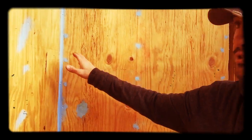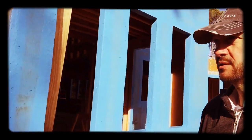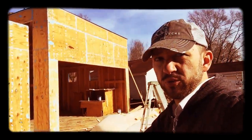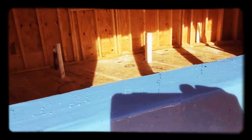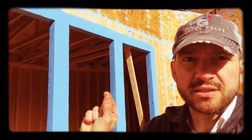Once the detailing is done — covering nail holes, seams, all around the windows where the seams are, other nail holes — and these corners are extremely important. Once we have all the detailing done, we wrap all the windows. We're still at that stage. You can see back here behind us — this is their 2400 product. You can see it goes on at about a 40 mil thickness. That's bubbling up because of the temperatures, the sun beating down on it right now. This is their flash and wrap system — this is their 2400, and it's thinner than the 2200, which is the stuff we use at the details.